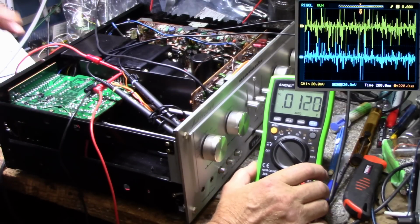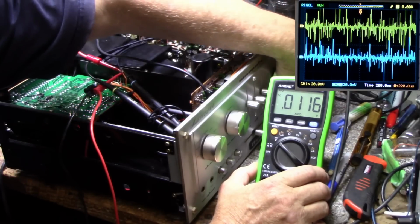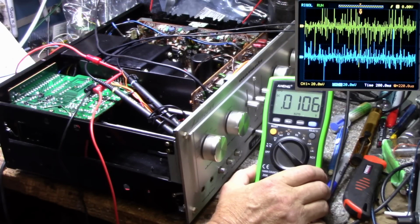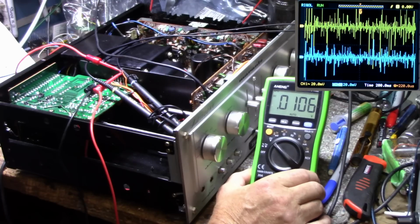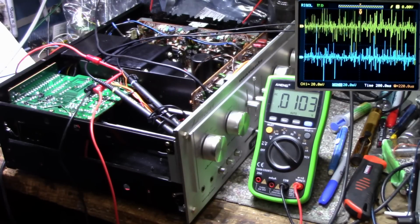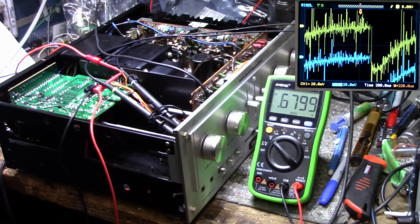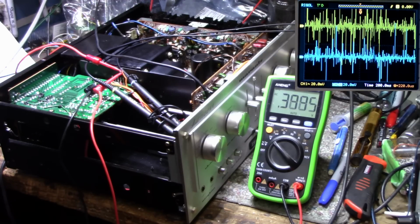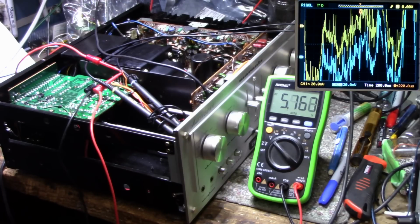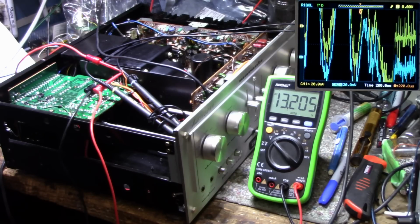So I have everything connected. Let's power this up. If I can get my hand in here, turn that on. And you can see the output of the 2 channels is running steady because there's no power feeding them. And this voltmeter will show you what I'm feeding for power. So let's turn this on, and let's start ramping up the voltage. I'm going to go up to 43 volts. You're going to see lots of twitching going on the scope as I ramp this up.